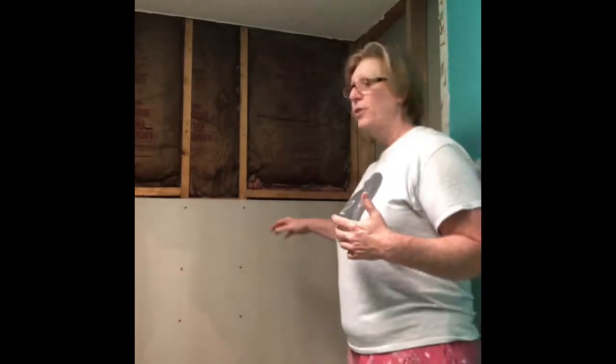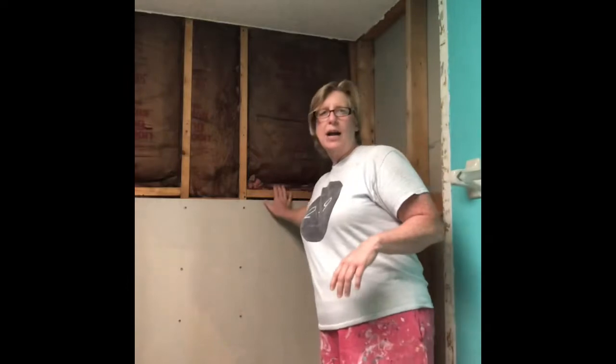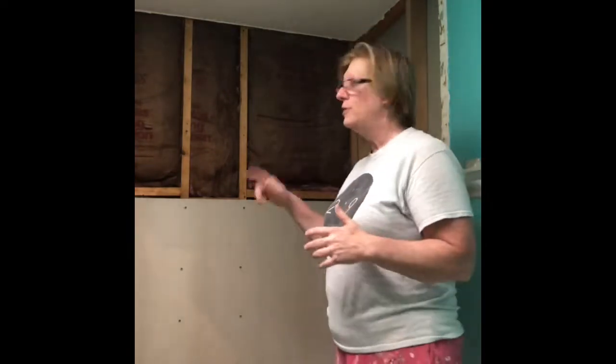Now, one thing that I learned in this process is there's a thing called Hardie backer board that is the newest rave and everybody is using it, or so they say. I've tried a piece of it, and I'm going to put a second piece up here, but honestly, I'm not a fan of it because trying to handle it by myself, it's a little heavy, it's fragile, and it creates silica dust when you cut it, which is not the best. Even though we should be wearing masks anyway when we cut things. But I'm going to go back to what I know, which is green board. It's drywall with a green facing on it, and I'm going to use that for the two walls.